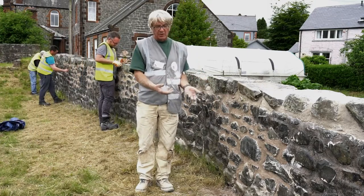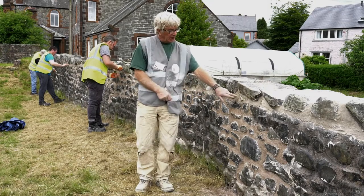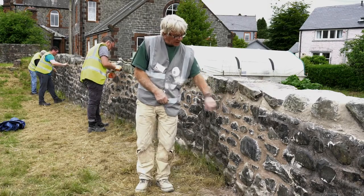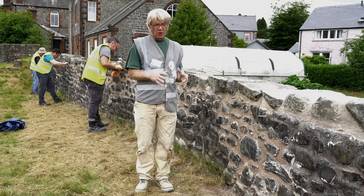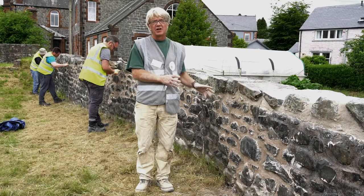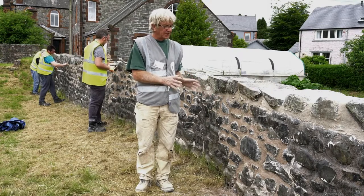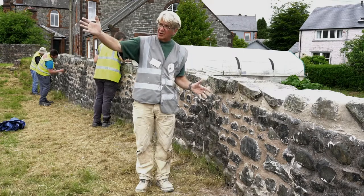So typically we would do that with a little piece of stick, a bit of plastering lath, take off that lime-rich surface and then beat it with a brush just to roughen it up a little. And what we're doing there is increasing the surface area quite significantly, but also it's a nicer texture to look at aesthetically. This has been done over the hair.